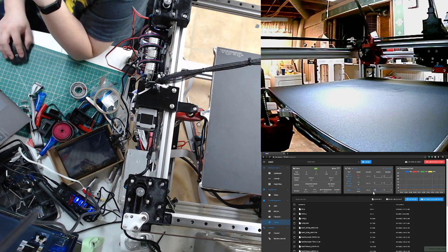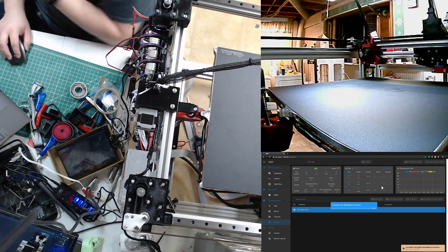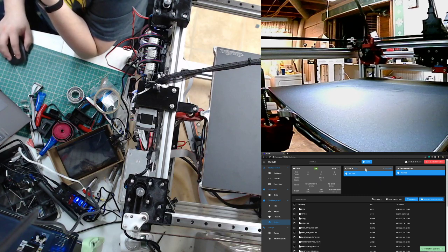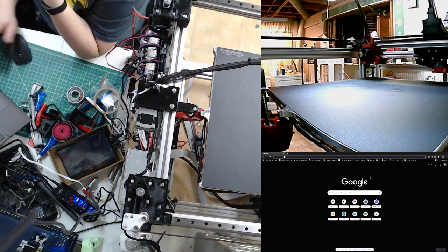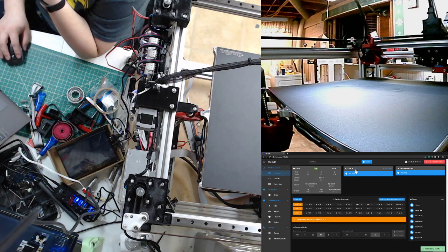Yeah, there are a bunch of students right now who all have Ender 3 Pros, and it's great. Some of them have issues where they can't print in part of their bed, and I'm like, oh darn, this is something mesh bed leveling would very quickly fix. Well, there is manual bed leveling where it walks you through the process from the control screen. Yeah, but this is after they've done that properly, and there's just a sag in the bed. That's unfortunate.